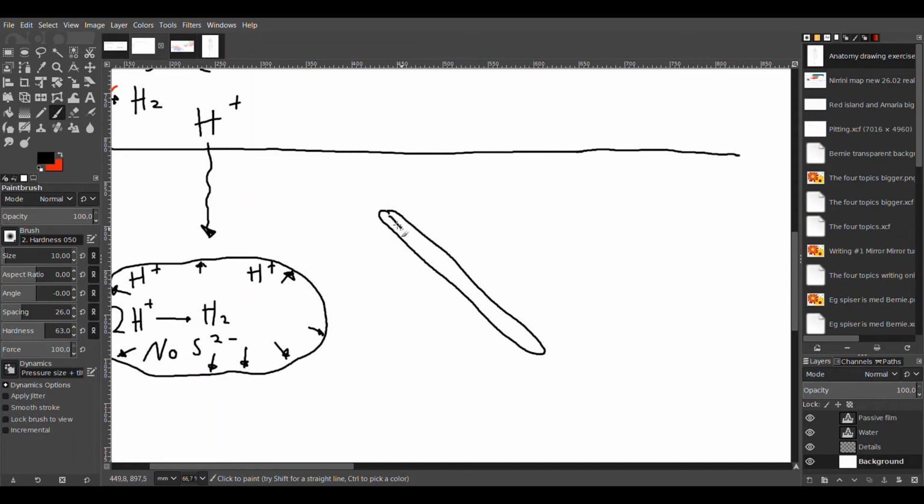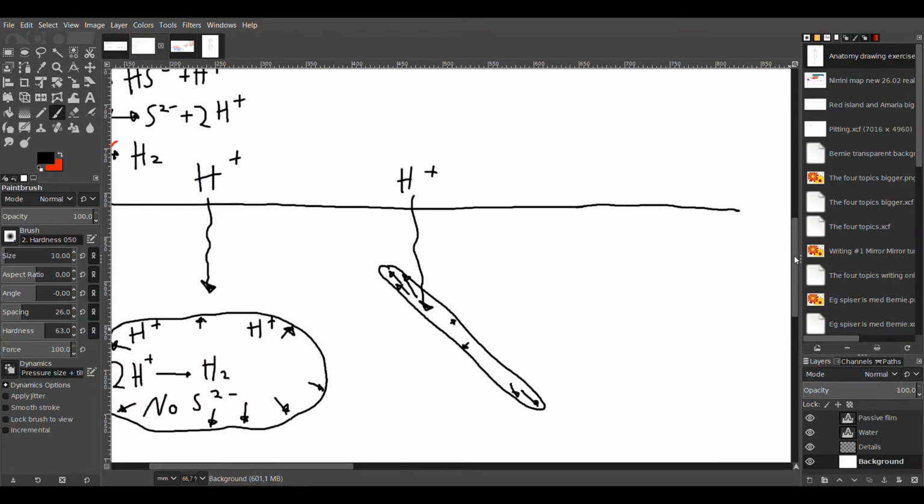And this is especially critical if the cavities have unwanted shapes, like being quite long and narrow, maybe a bit pointed. If that happens, it can take less pressure than others, and it will crack up to the surface for a pressure release. So this can be quite damaging and could be hard to predict.